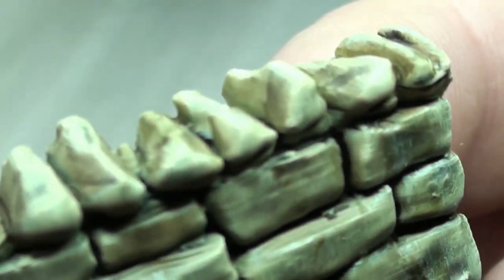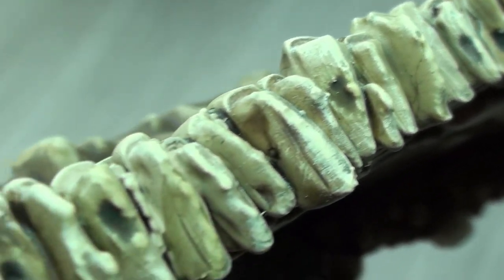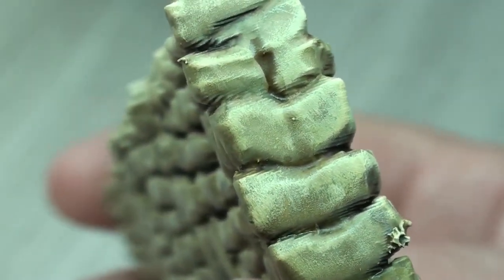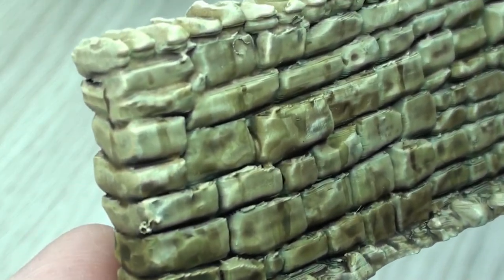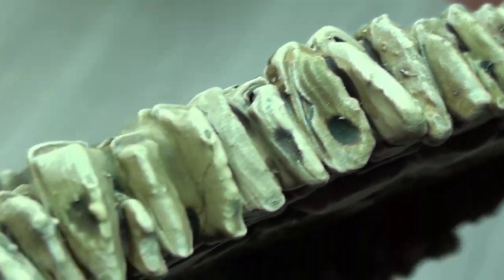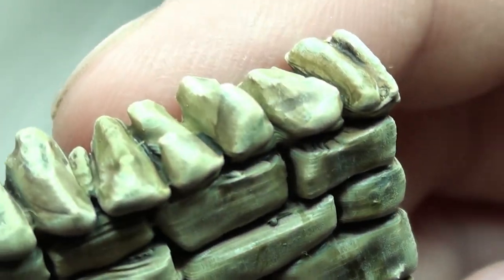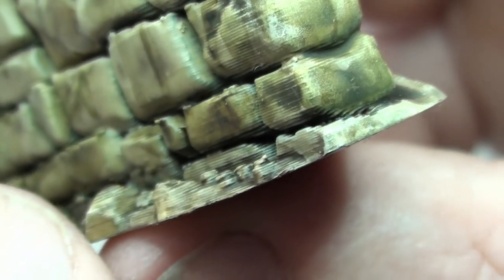And if you look there, pretty sure there's minimal texture along that wall. The ends look good, and anywhere that you can see a little bit of texture, it's probably where I've just missed putting the product. The top, you see a few striations there where it's got the fish scaling, but I wonder if a second application wouldn't have sorted that out. But in terms of what you can see, I think that's a pretty good job.